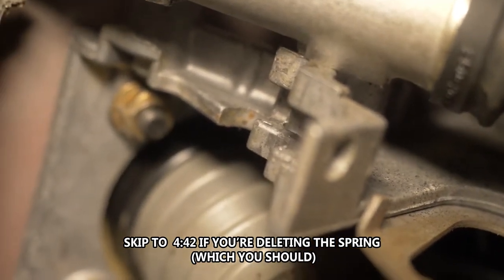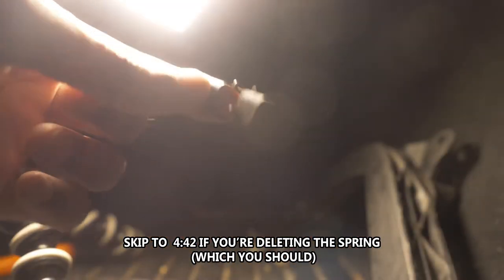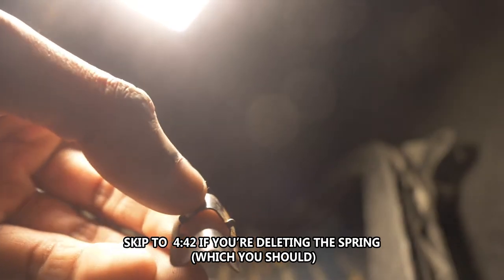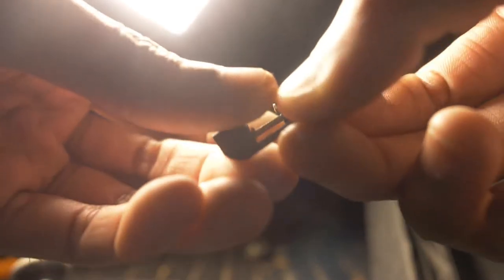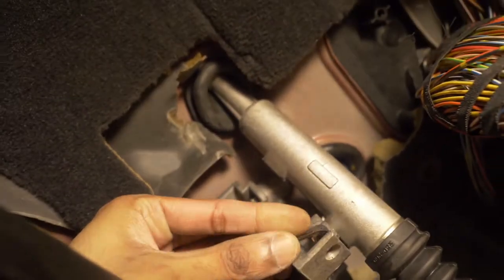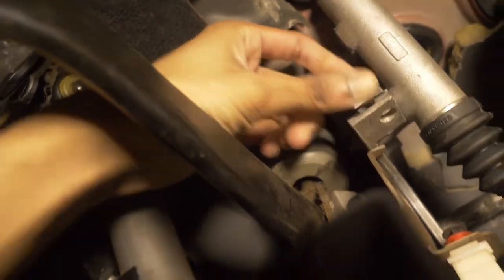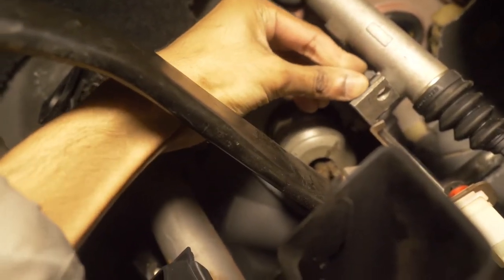What you want to do is put the metal clip on first. This clip that sits on top of the spring goes on that groove I just showed you — not the second big one, but the V-groove. If it doesn't sit in there by itself, you can see these small pins — bend them outwards and they should press into the aluminum part, into the groove. This thing should then sit there by itself.